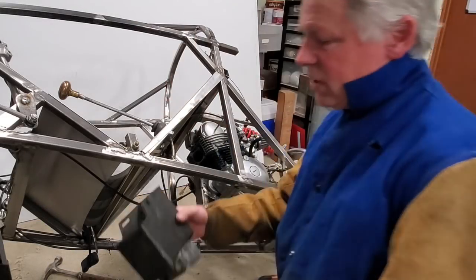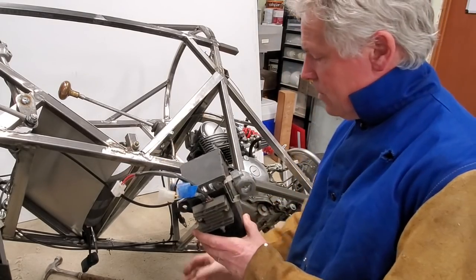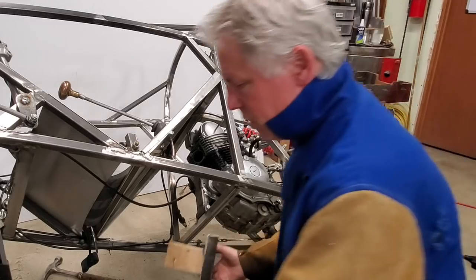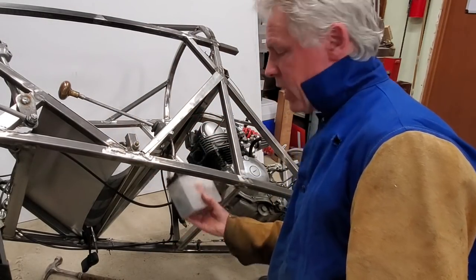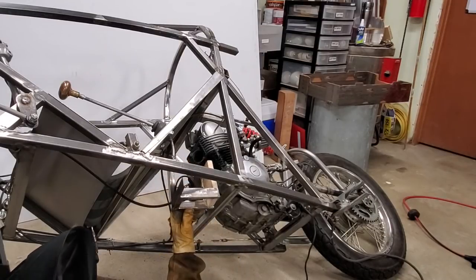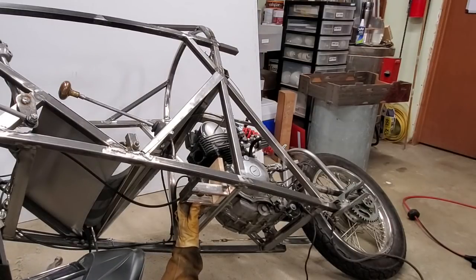This was the battery box that came with the motorcycle, and it was a little heavy. I made this little guy out of some lightweight angle iron and we put the battery right about here. This board is an exact footprint of the battery. Making sure it's not going to snap into the shifting rod — I've got about three-eighths of an inch there. I'll be good.